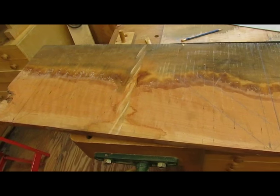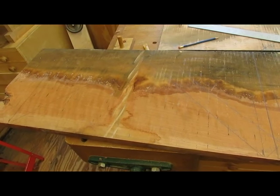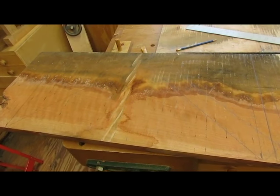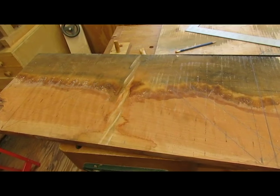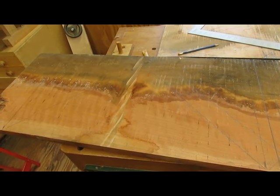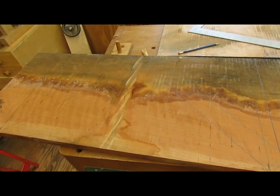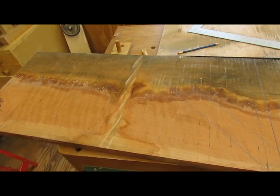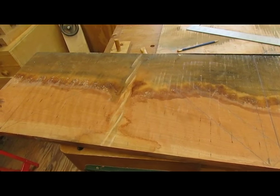So the top material I think is straightened away. I've got to pick up some wood for the sides now. This part of the board isn't used for the top, so I'm going to chop it off — it's only about 36 inches long, which as a single piece would make the two front aprons. That way all the material will have come out of these two boards, which means the color and grain should match.